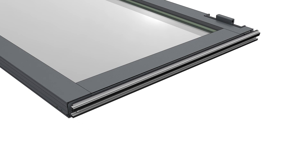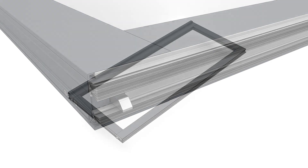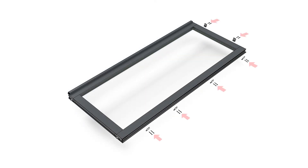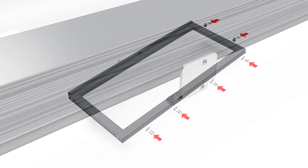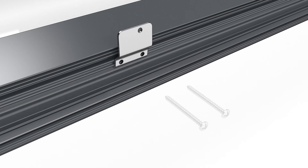When using a saddle sill, attach the pile weather strip on the bottom of the panel. Install stationary brackets onto the panel and fasten the brackets with number 8 by 1 and 3 quarter inch screws provided.